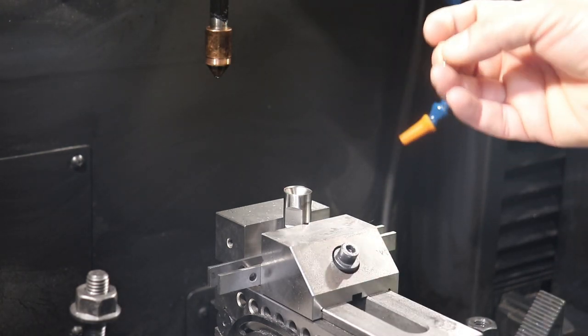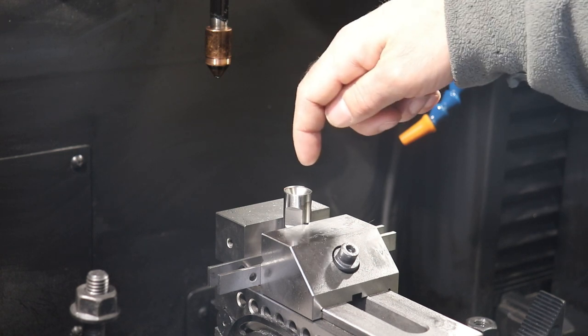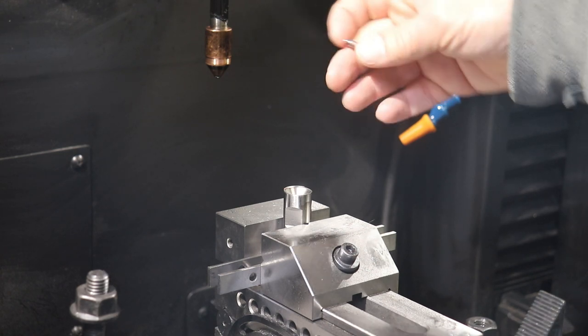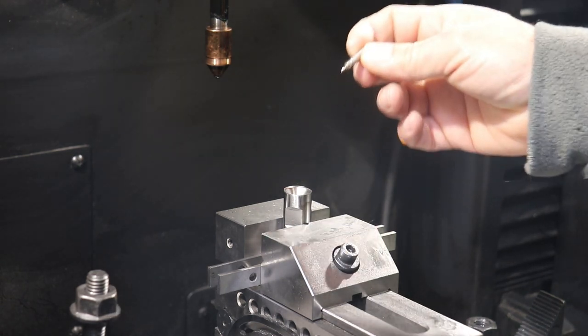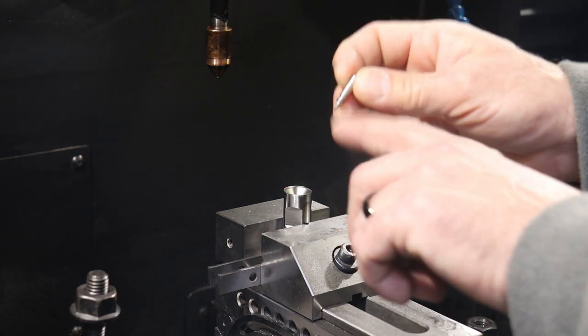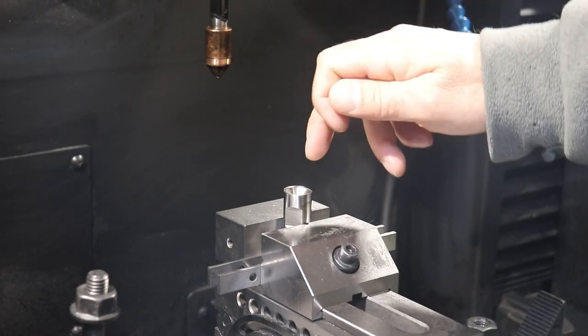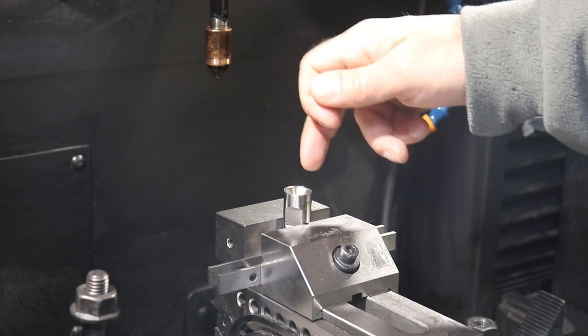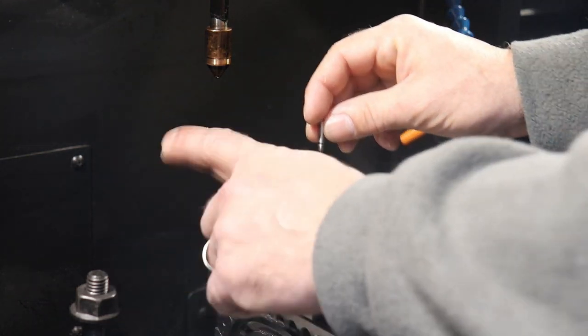Anyway, so the next step is to cut an axial hole down the center of our hole punch, probably all the way through, so that we can glue this cylinder in place. There is a 10-32 thread at the bottom, but I don't think we can practically cut a 10-32 thread into this hard tool steel cutter, and then a hose will come out the bottom of this guy.